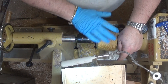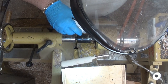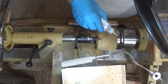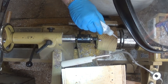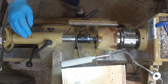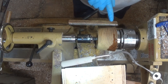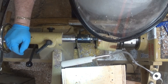Before I go any further, I'm going to stabilize these cracks with CA glue. I'll let that dry for a little while so I don't fling CA all over me. Because this is all end grain and it's really hard anyway, I've got a little tear-out there but I'm not going to worry about that right now. What I'm going to do is make a couple of passes with a texturing tool and give some texture to the side of this. I think it'll make it pretty.